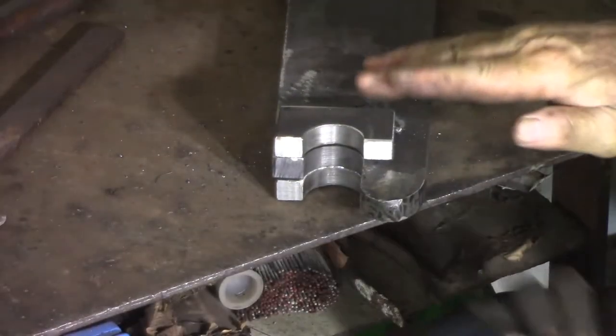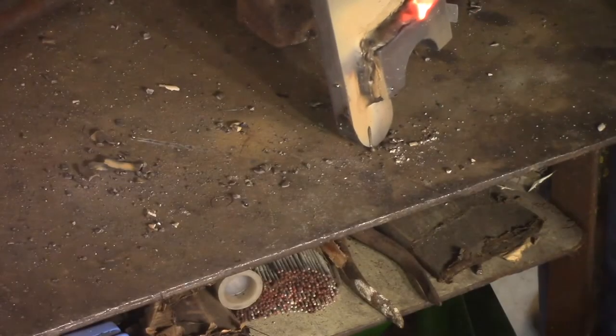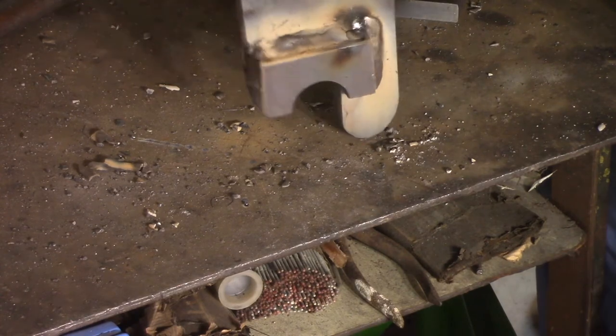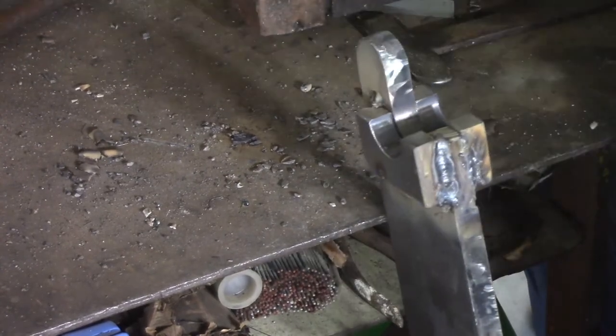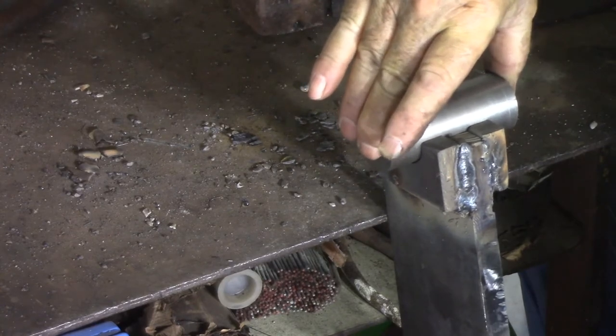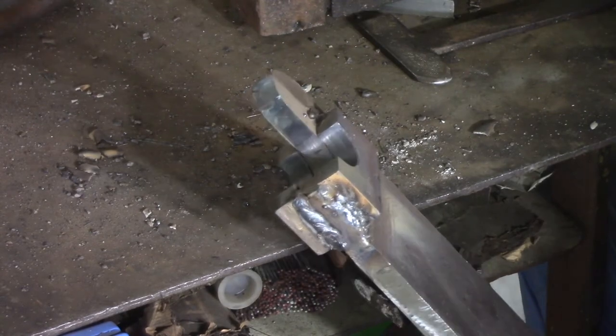Not unexpectedly that's pulled these top ends out. I'm going to pull them back together and then go down these sides. The welds are good — the only criticism I've got is that they're not as even as I'd like, but the welds themselves are good. There's not a terrible lot of force on these stirrup locks. Because the welds pulled I've got a quarter of a millimeter maybe of wobble in there, but I don't think that's going to matter once it all gets together. I'll do the other one off camera but that gives you the idea.